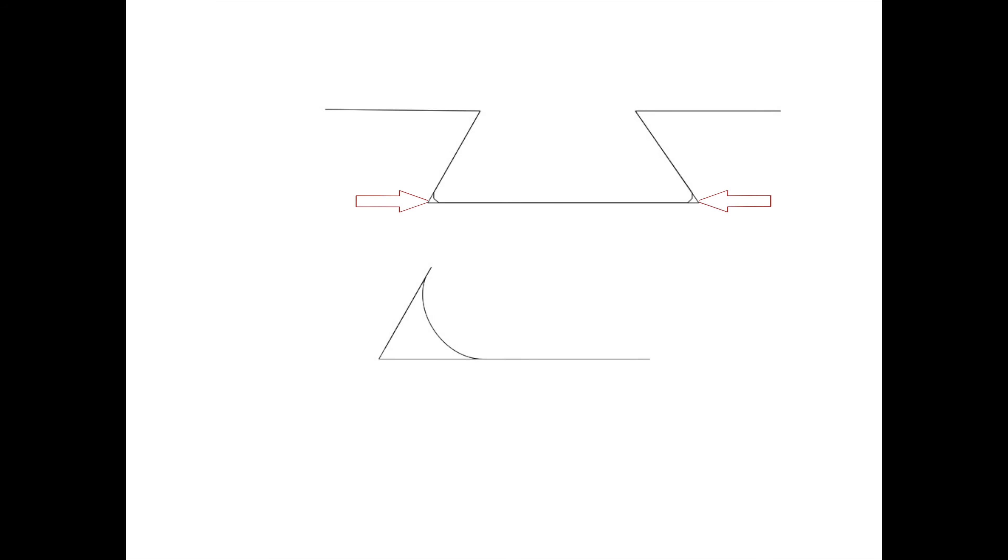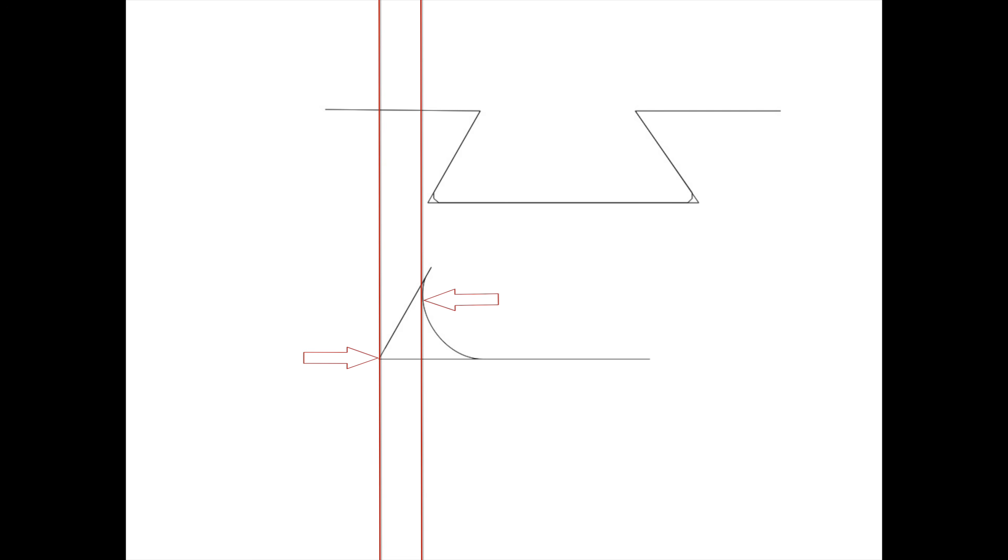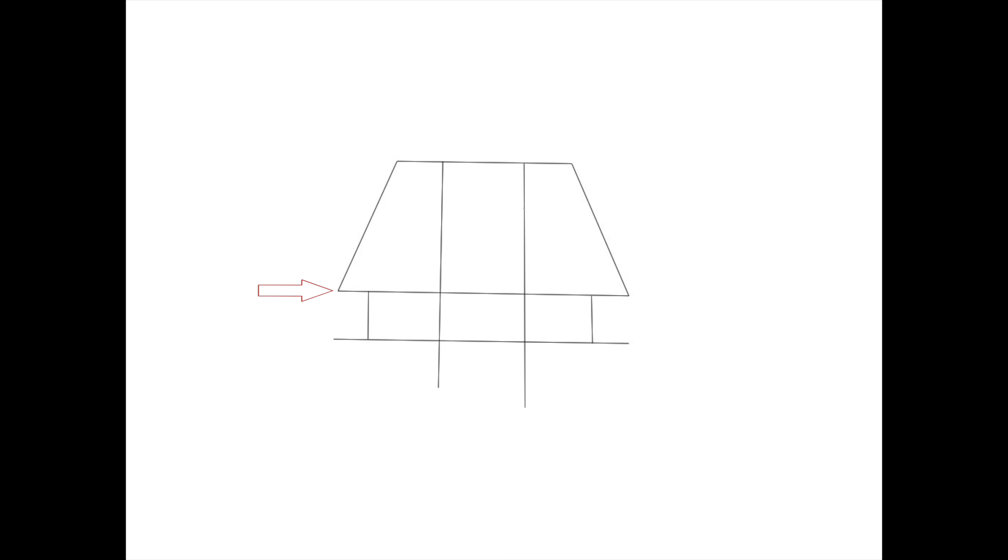This is the cross section of the dovetail groove in the arbor body — I need to fit a dovetail button into it. It needs to be snug and remain flush or below flush to the outside face when fastened in. As I can't really measure it, all I can do is make calculations from my initial sketches. The diameter I need is not across the top dimension but across the bottom dimension, to ensure that the tapered sides fit together as snugly as possible — effectively adding this much to both sides of the bottom.